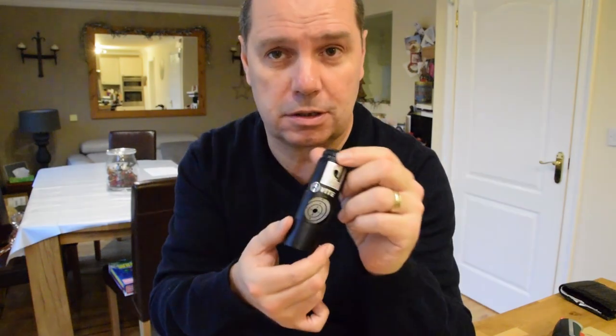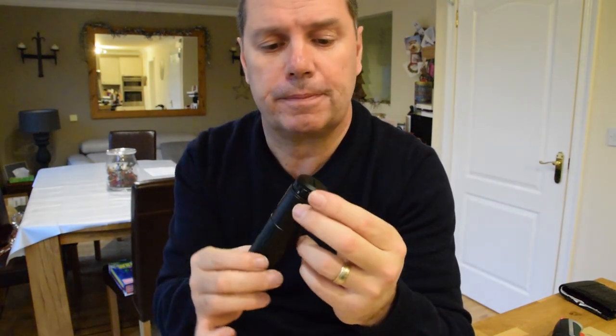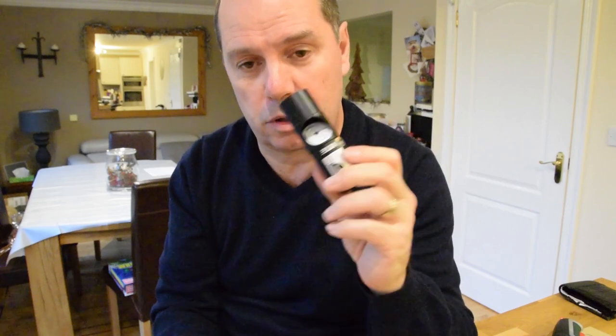Yes, hi everybody. Very short video today. I just want to talk to you about these things, laser collimators. Now, if you've got a reflecting telescope, you'll probably know that you need to collimate the optical train. That basically means align the secondary mirror and the eyepiece and the primary mirror. And to do that, you can either use a laser collimator or something like a collimating cap or a Cheshire.